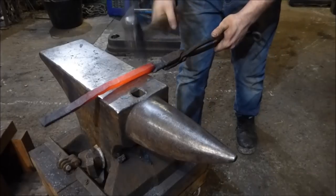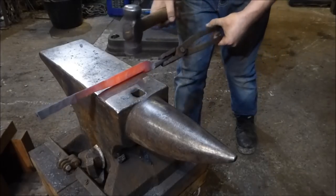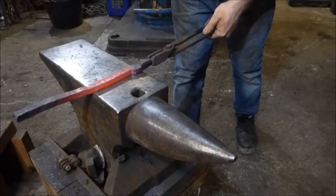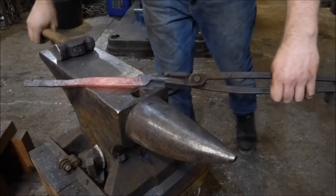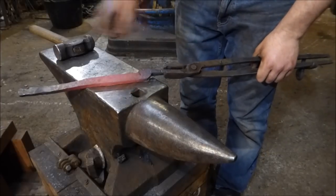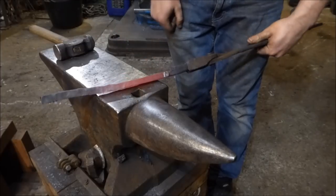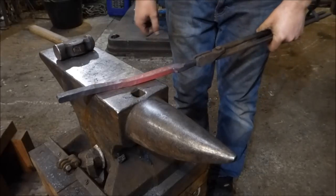I'm losing a lot of temperature now. All I'm going to do on these last blows is just work through the heat and take the corners off of my material — just like so. This is still a little bit too thick but that's not a problem. All I'm going to do now is draw the reins out so that they're the same width as the hinge plate and get this all drawn out so it's a nice even length.